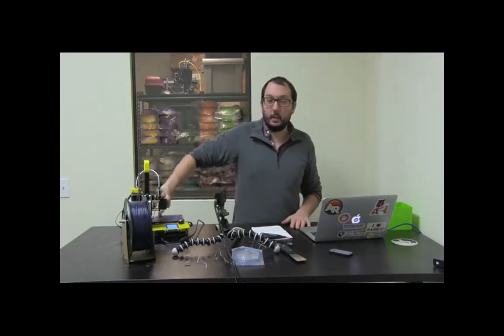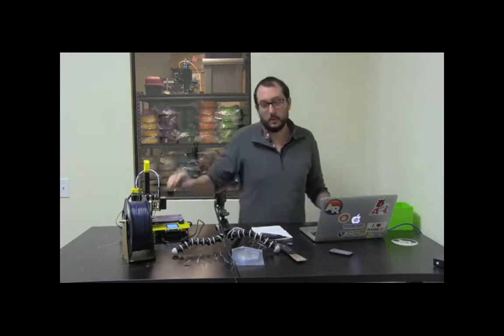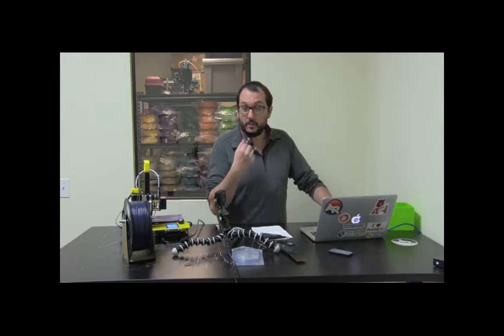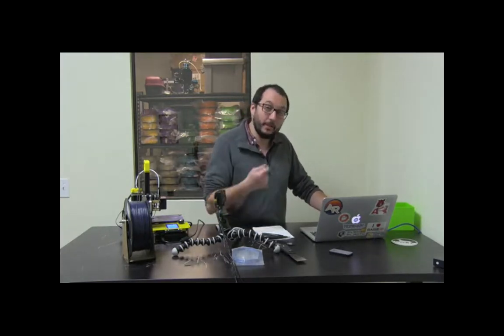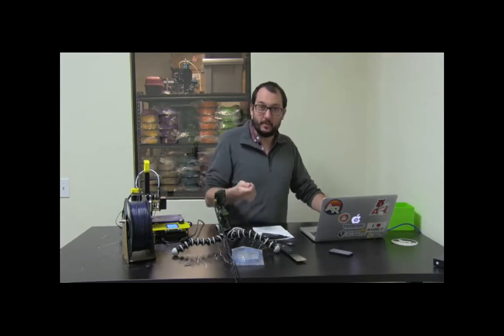You never want to take apart the extruder assembly and stuff like that. And if you feel like you want to take it apart, or somebody wants to take it apart, please contact us and we'll have you try some stuff and then walk you through how to do it, because there's a very particular way that has to go back together. So these two steps that you can do will clear nearly all the clogs. And you also have a filament unclogging tool that comes in all the toolkits. That's a little wire that you can floss the nozzle out with as well.